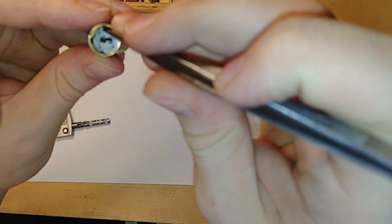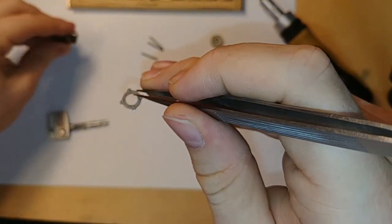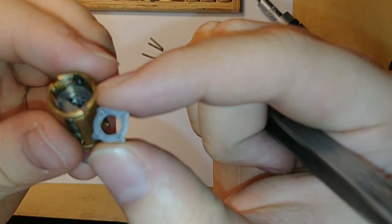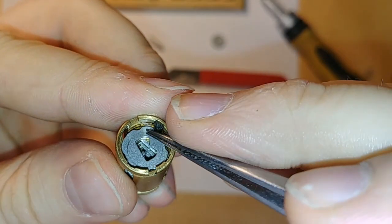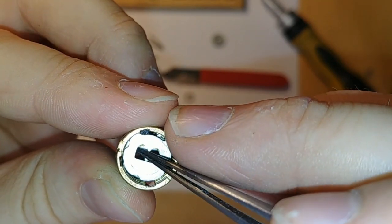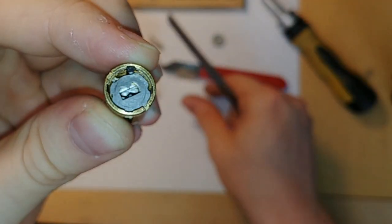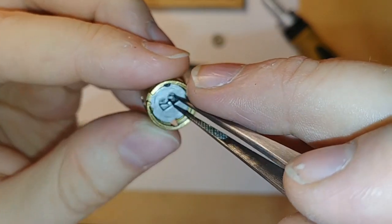Then, if I take now the black sidebar out, or push it over, I can rotate this fancy wafer out, and now I have this really cool wafer. You can see there are 4 tiny ball bearings in there to make it run smoother, and these are actually spacing the discs in the core so that we can't change the position of each disc. So this disc here lies freely in here. It can't rotate further because these grooves here hit the plastic sidebar. So these two here are the maximum rotations we can get, and it could move up and down if there weren't these discs. You can see they have some wings which engage with these grooves here, so they are really precisely placing each disc at its meant position.